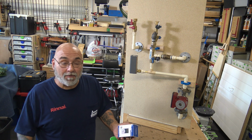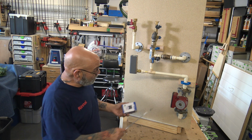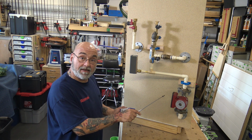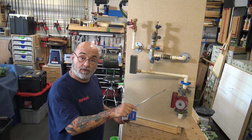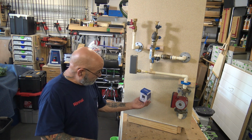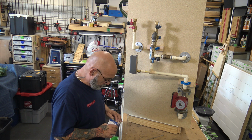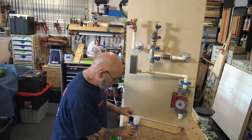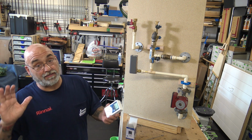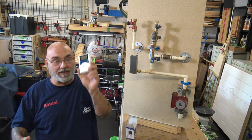So what does this do? You plug this in. Now there is a timer on here that you can set. So there's an outlet. You put a pigtail on this with a plug. So again, hot, ground, neutral, to a plug, pre-made, pre-bought, 2 foot. Plug this into your outlet, plug this into there. And I gotta step back something. This is not the Google Home. This is just the timer, because we actually carry 3. We carry Google Home, we carry Alexa, and then if no one has that, this is what we use.